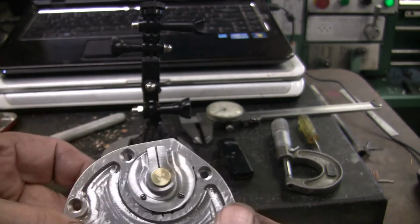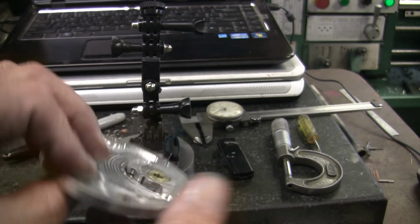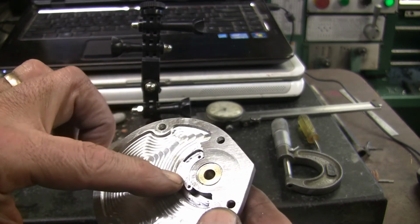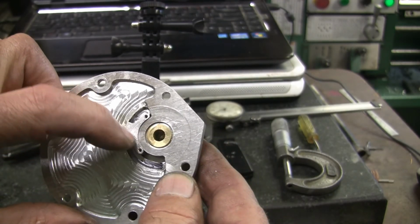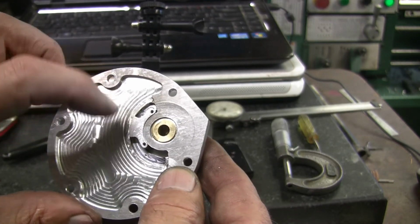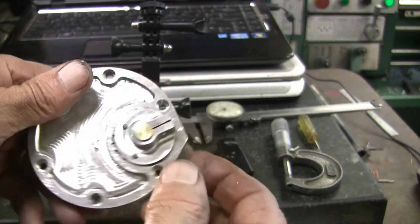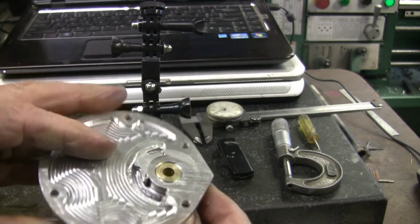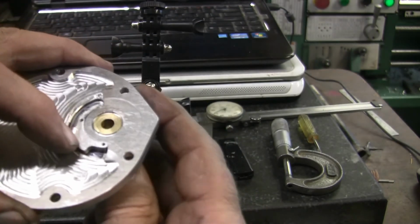Okay, here it is. That's two little screws in it, and it's attached to the back side. I still got to mill the slot in it. I'm going to epoxy two Hall effect sensors together first, so I know the depths and sizes, but I can adjust it back and forth. When I adjust that, it naturally turns the other.